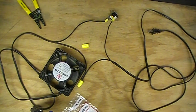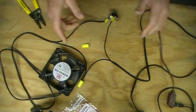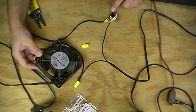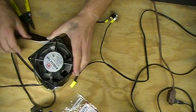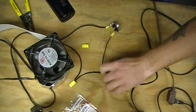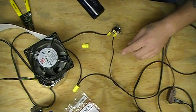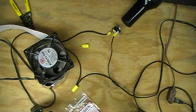All I'm gonna do now is plug it in and add some power to it. Now it's activated — there's actually power going through it up to the switch. To actually make the fan run, we need to jump the switch open so you can see it. I'm going to take heat — which is a hairdryer in this case — and be careful: tape all these up with electrical tape so you don't get shocked. I'm going to put some heat to it, and when it reaches 110 degrees it's gonna kick the switch on.